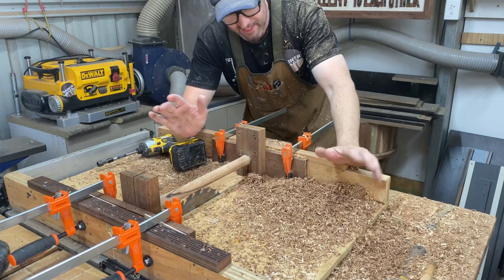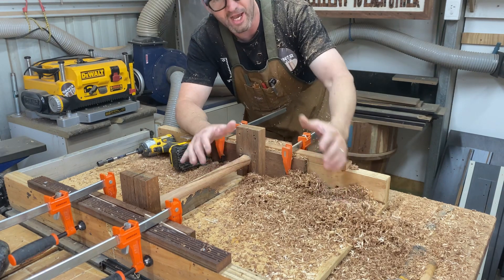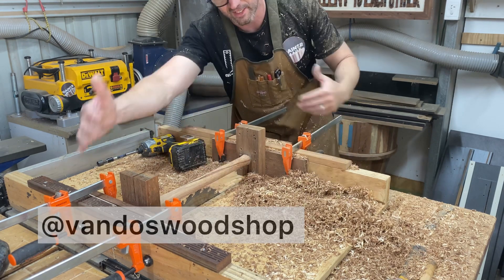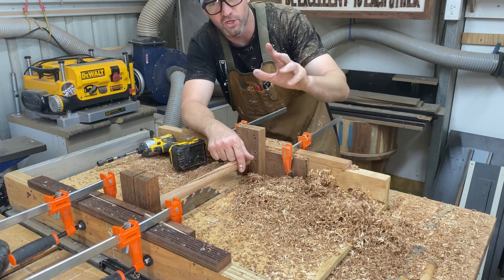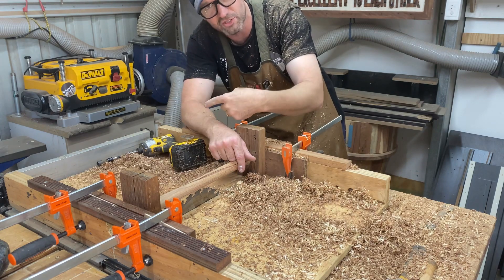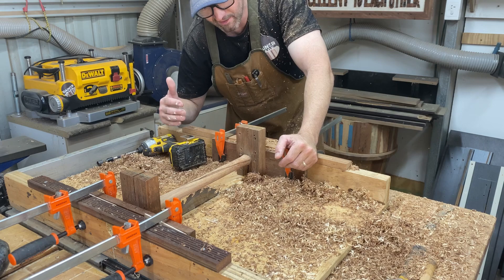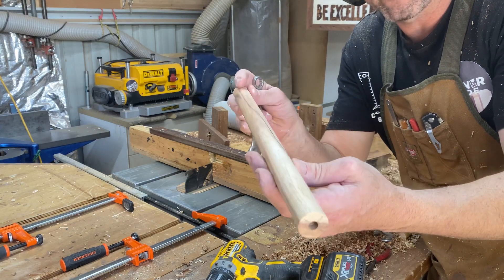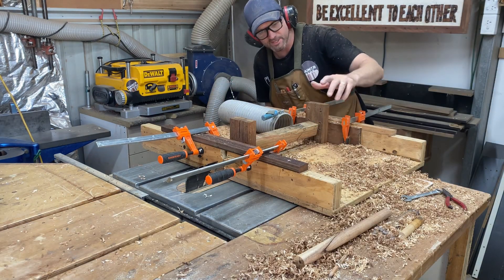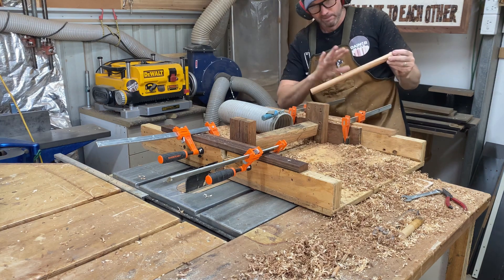As you can see, very messy. If that doesn't bother you, then this jig - if you're just doing a few - will be totally fine. If you want to see the enclosed version, Anthony from Vando's Woodshop has actually just gone through the whole process and made the enclosed one with acrylic and all the good gear. I'm just going to do one more experiment - I'm going to spin the dowel the other way to see if the bulk of my dust goes out this side. My dust extraction is over here, so if I can maybe suck a little bit of that, I'll be on a bit of a winner. It is set to my 25mm, so I can batch it out.